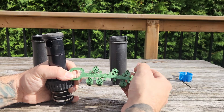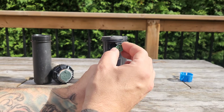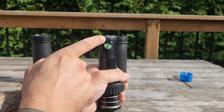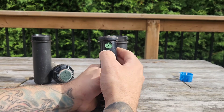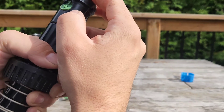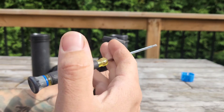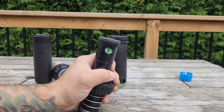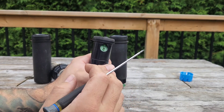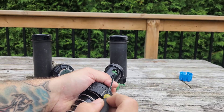To remove the nozzle from the tree, just pluck it off and turn it a couple times — it pops right off. Installing a new nozzle in a new sprinkler is super easy. Make sure the retention screw is all the way backed off, then line up the top of the nozzle and give it a firm push with your thumb. If there's difficulty, check for extra plastic in the nozzle opening — there was a little overhang preventing the nozzle from going in. Press it on your knee if needed until it's recessed in the nozzle groove.